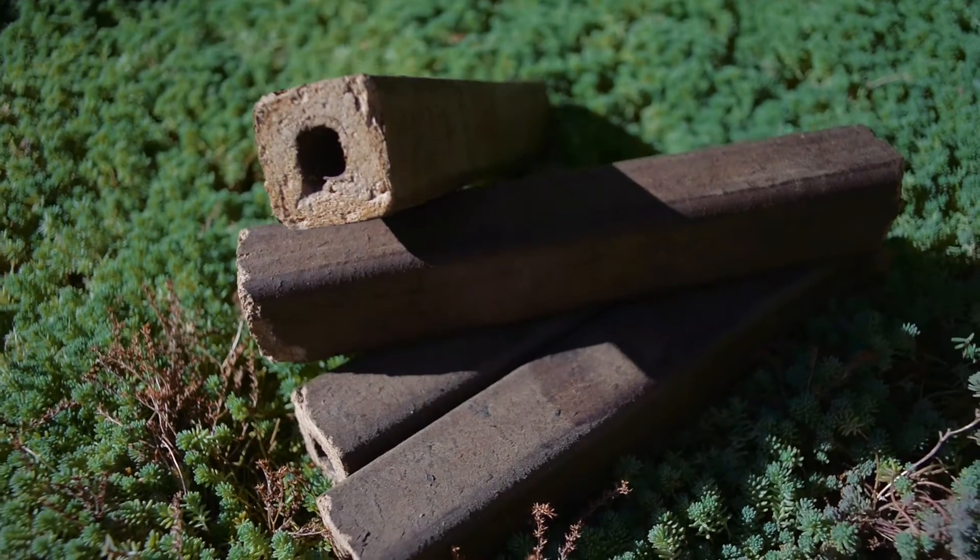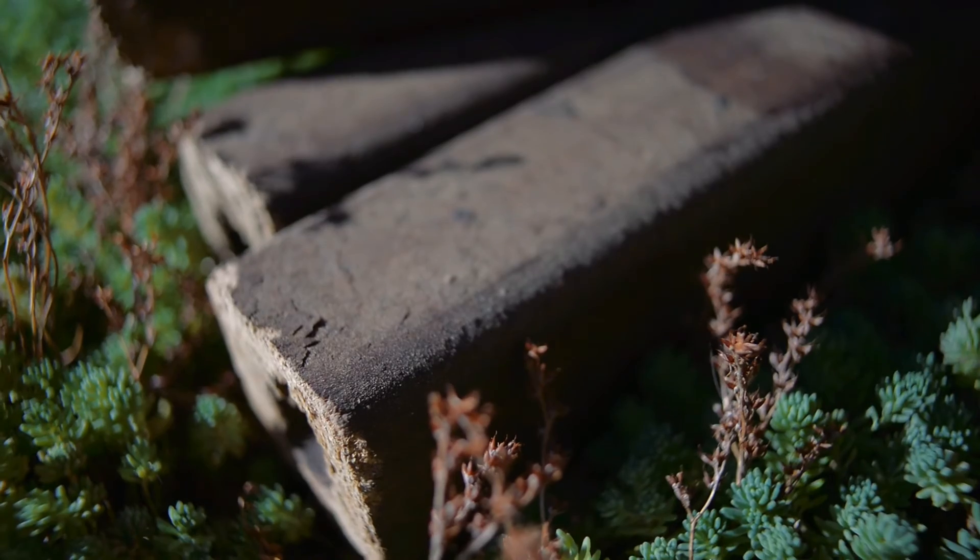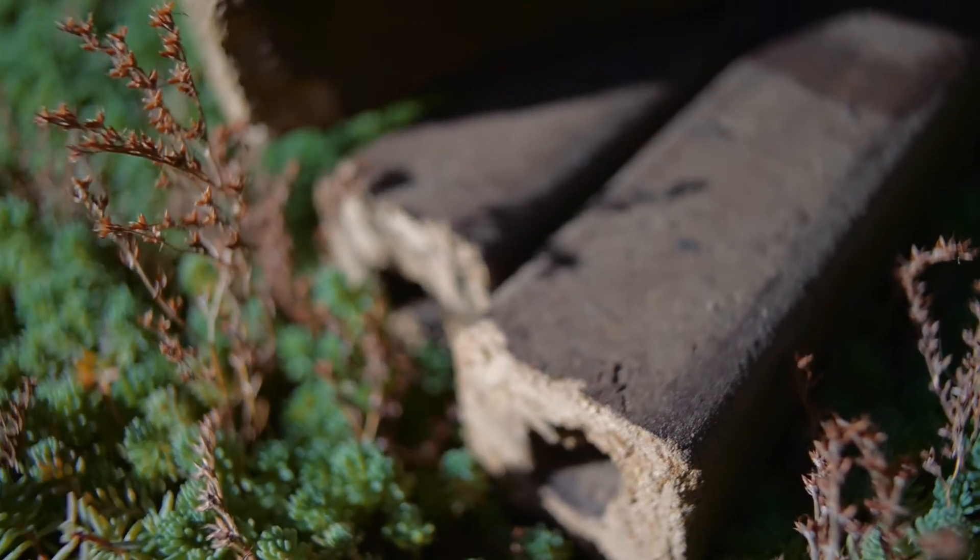Despite these high raw material requirements, many people still choose Pini-Kay technology because of the high demand for this type of briquette. The Pini-Kay briquettes have the highest density and consequently the highest calorific value compared with competing technologies. Therefore, the price in European markets is up to 400 euros per ton of finished product. The main benefits are the quality and market price of briquettes, while the disadvantages are the complexity of the technological process, fire hazards, and the need for smoke disposal.